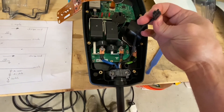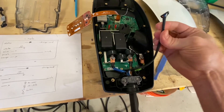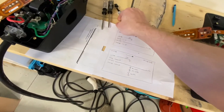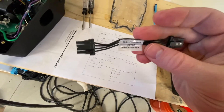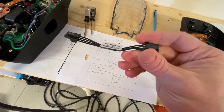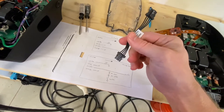So what I did is I went and found this connector online so that I could do some splicing and try to work around this extra cable without destroying my Tesla charging cable, so I could swap it back later if I wanted to. I found this online — it's a Molex part, number 145-132-0400. I can use one of these to splice on and that will keep me from destroying my OEM Tesla cable.